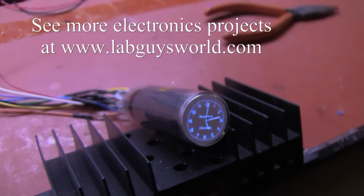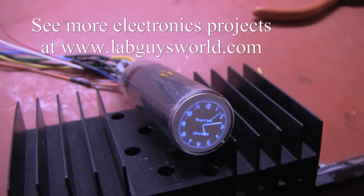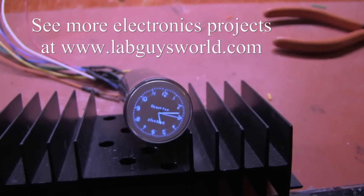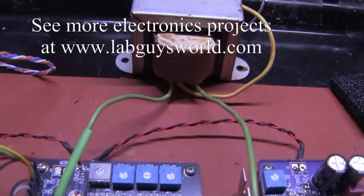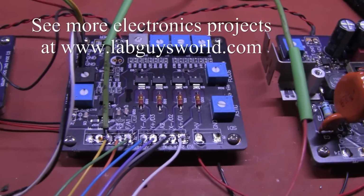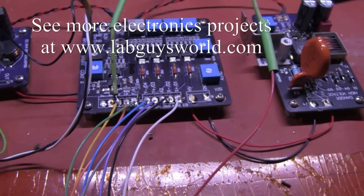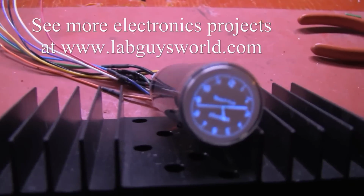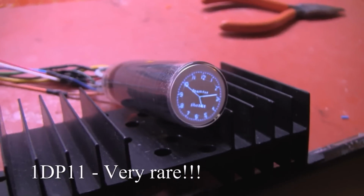1DP11. Working with a scope clock display. This one has a condition where it shares a pin between two internal electrodes. The heater and the cathode share one pin. So over here is my heater transformer that puts out 6 volts, and you'll note that this side of it, over here where I don't want to get shocked, is tied to the cathode pin on Eric's board. It shares that pin with the cathode. The other side of the heater circuit comes over normally. All 4 deflection plates on this tube route to their own separate pins.